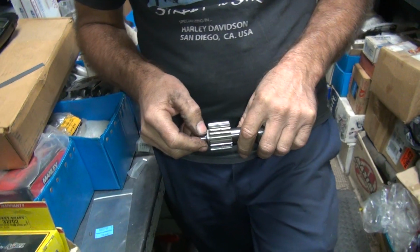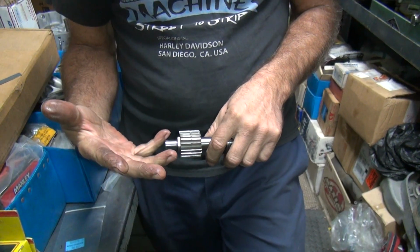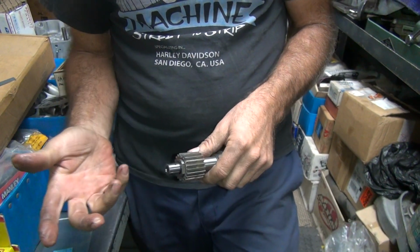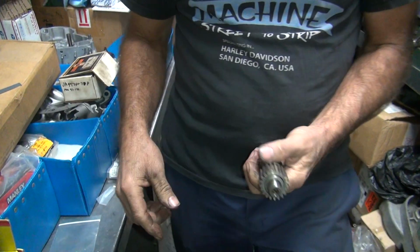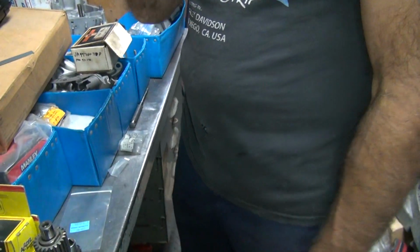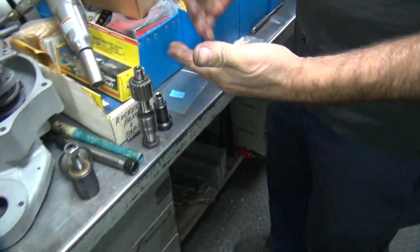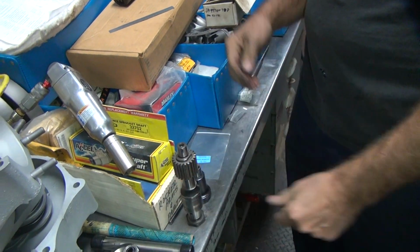We can lose a little bit. We can probably get 30 here and 30 over there. That's a 16th. Hopefully we had 30 thou to begin with. Now we've got 30 more somewhere else we have to come up with. But we don't know if we have that or not until we put the motor together, and then we find out it hits. So basically make it clear without a gasket, and the gasket will be your clearance. Right. That's all you can do.